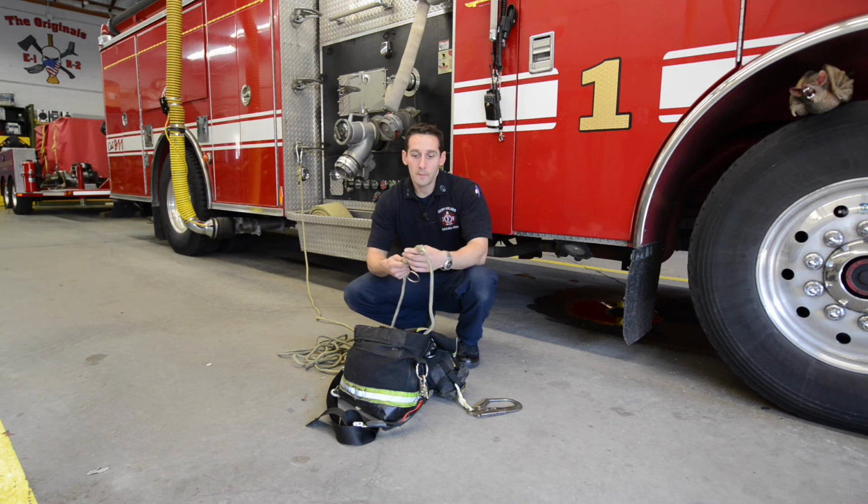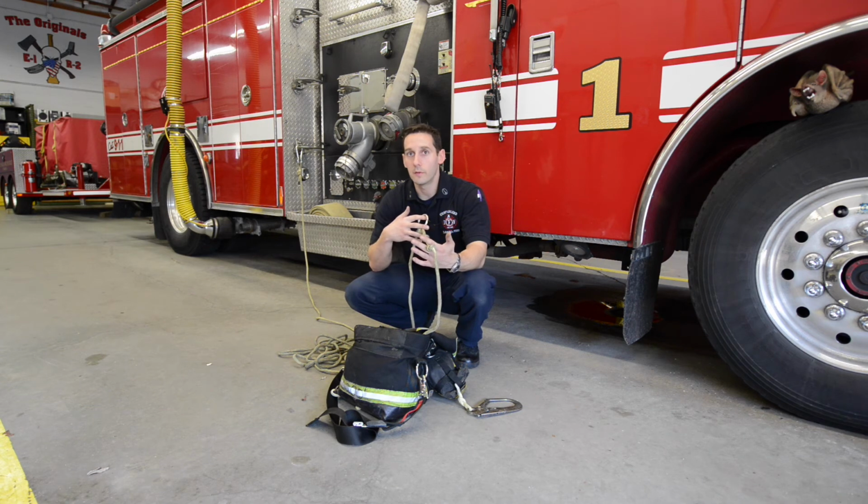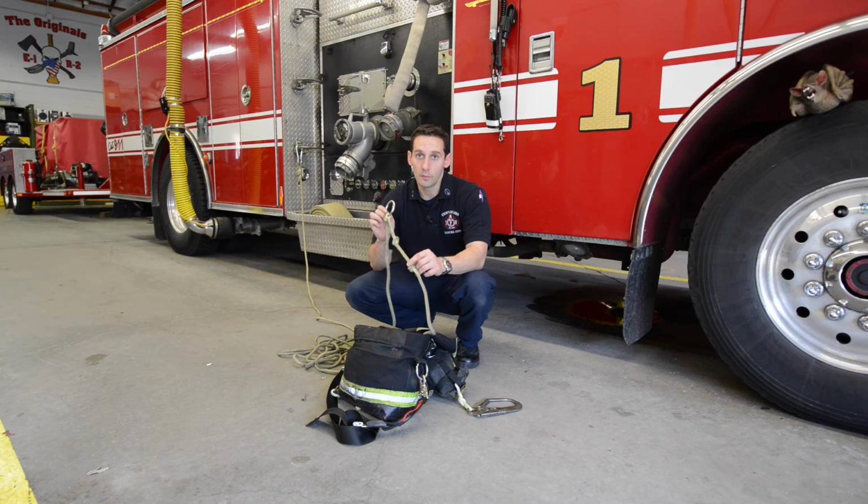It's a good idea to dedicate this to memory. The knots go towards the fire, and they do not go towards the exit. The ring side will lead you out of the building. The knots will get you into trouble, okay? Knots towards the fire. The knots do not go towards the exit. The rings will take you outside. Ring return. So try to remember that. Dedicate that to memory. Every knot that you find is 20 feet, all the way up to the 200-foot mark